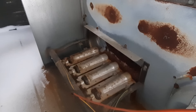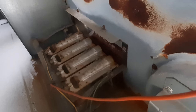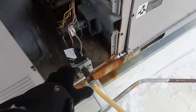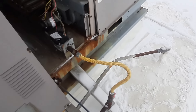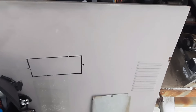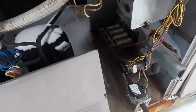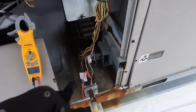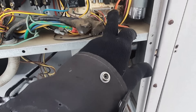There we go - it does look like a good spark. The gas valve's on. The gas line goes down inside the building and there's no regulator up here. Alright, now we don't have a lockout. Let's see if I'm getting voltage to that gas valve. I'm working with one frozen hand here - and I'm not getting voltage at either one of my leads on the gas valve.